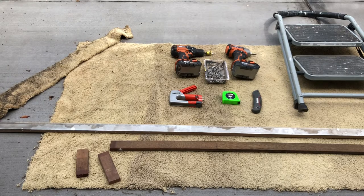You're also going to need a staple gun to help tack it up, some wood offcuts to help brace the carpet against the timber or masonry, a stepladder, a drill, an impact driver, some appropriate screws — whether that be wood or masonry screws — a tape measure, and a Stanley knife to help cut the carpet. And with that, we're ready to crack on.